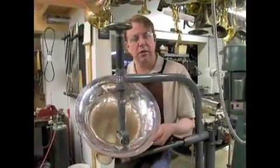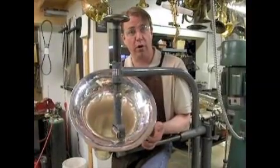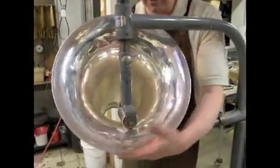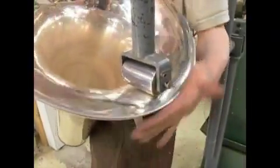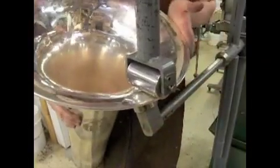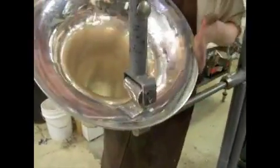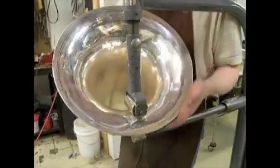If you're just racing around on it, you're just going to be hopping over everything, and it's going to take a lot longer, and you're actually going to work the metal harder. You don't want to do that, because that's what we need to crack it. So at this stage, we've been working on it not very long, and when we've applied the pressure, things start to smooth out. You can see all of that used Reynolds wrap look — like old aluminum foil after you've done cooking with it and it's all crinkled up — well, it's going away. So we're very gently smoothing it. We're not hammering or beating out the distortion. We're just unfolding. We're taking our time.